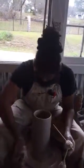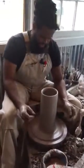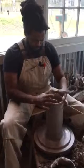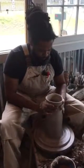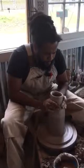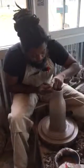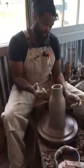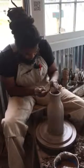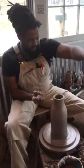So now I'm going to bring this top in. I'm going to make a triangle with my hands. Now I'm going to go here — this is how I bring the top. I'm going to get that top down to about two and a half inches. All those out here, I'm going to have to bring that back in now — make a triangle with my hands like that. I'm going to circle into a triangle, just going to collar that in. Three points of pressure. Now you see it wobble in the top — I've got to take care of that because if I don't, it's going to affect everything below. I'm going to draw a line, take my finger aside. That's that wobble too. You can see I even that in on the other side — I have to remove that.